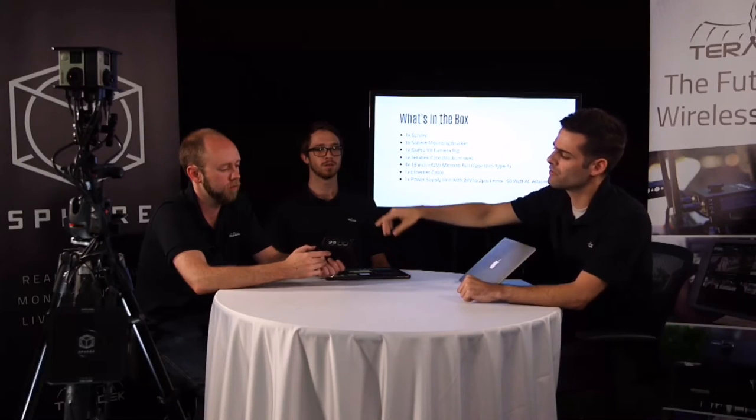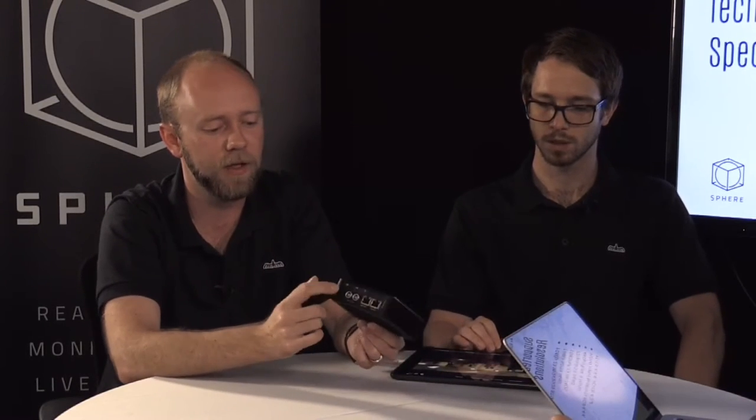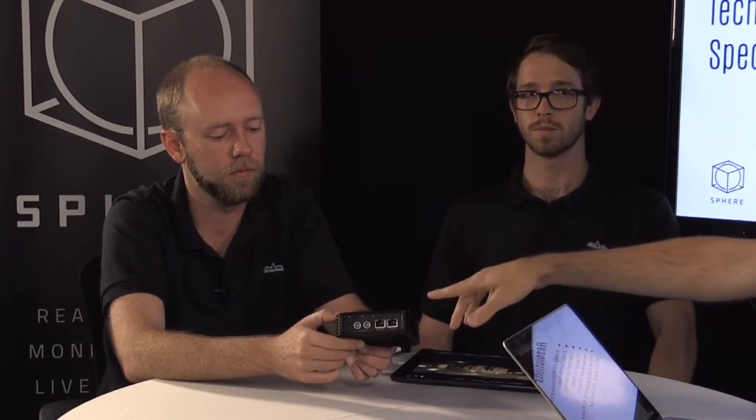New for the Sphere is an analog audio input — a 3.5mm jack. It's a stereo eighth-inch line level input so that you can use it with two channels, for example with the Rode 360 audio microphone. That's actually connected to the fourth encoder. When you configure it in the Sphere, you'll see the fourth encoder has an analog input available. You can set whether you want to take the analog in or the camera's audio — HDMI embedded audio from any of the four HDMI inputs, or analog on the fourth input.